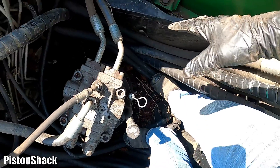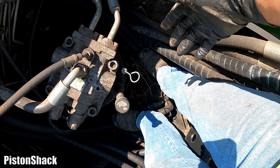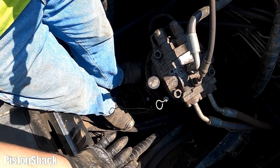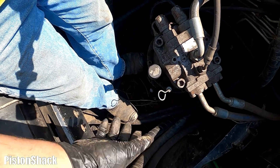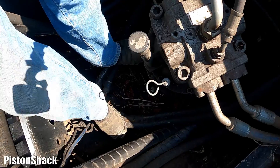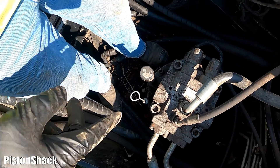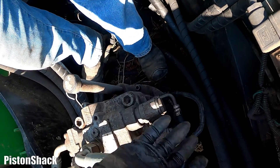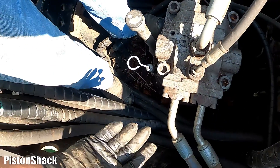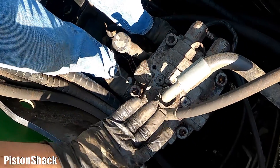One very important part: when you step down into the pit, just watch where you're stepping. Always watch your step — you don't want to step on the harnesses or electrical connectors, and some light pilot lines. Those big power lines you won't break, but watch for tiny little hydraulic fittings. I've seen a few times when someone's trying to fix one thing, they step on the wiring harness and break a connector solenoid. Be careful where you step — when we're fixing one thing, don't want to break something else.